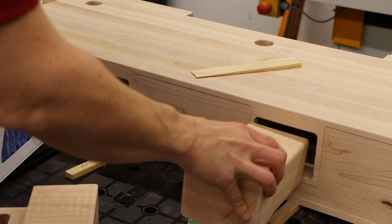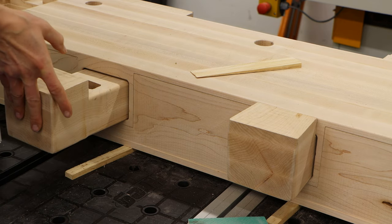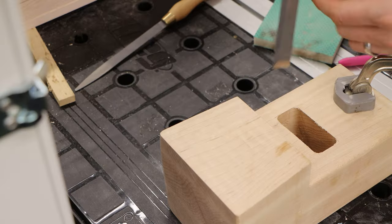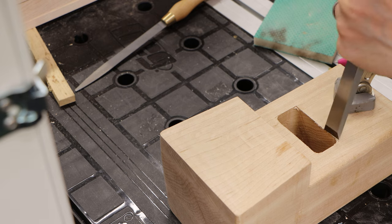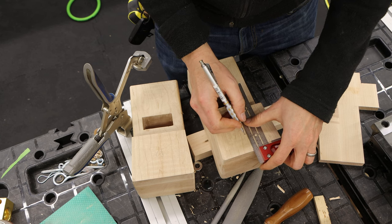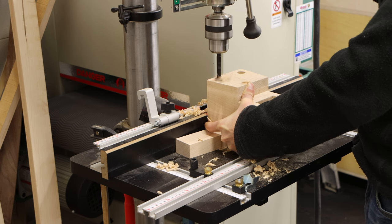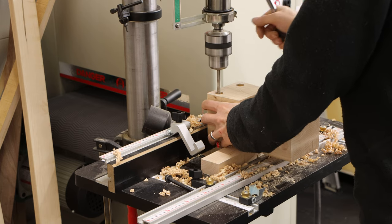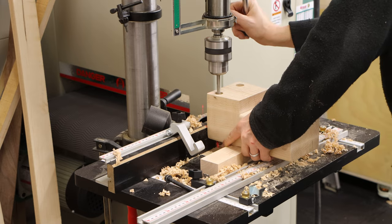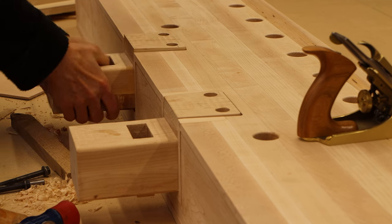Now the first of a few moments of truth. This was extremely satisfying — I might have done this 4 or 5 times. The one place I couldn't have roundover corners was the slots for the bushings. The bushings have 90 degree corners, and the slots have to match. These are mainly held in place with the mechanical dovetail joint, but there are also two recessed bolts installed to prevent any vertical movement. The bolts get recessed 1 inch deep into the wedges, and the holes are cut into the outside edges of the dovetail to allow the vise screws to pass between the bolts and into the fixed slab.